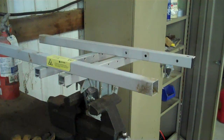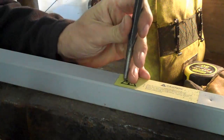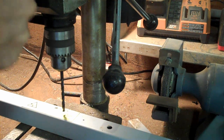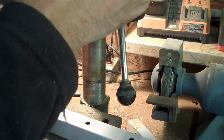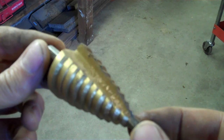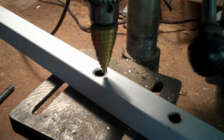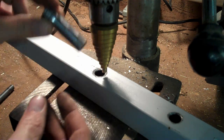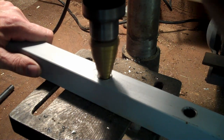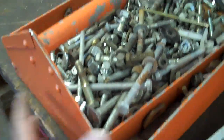I've got the square stock off of the old satellite dish, so I'm just laying this out where I'll drill these holes and bolt this together. That'll be really solid and relatively weatherproof. If you're gonna have one drill bit in your whole toolbox, it's a step drill. I've been using these cheap ones from Harbor Freight and I've been really surprised how well they've held up — they're just perfect for a job like this where you need to bore a really large hole. The bolt we're using has a 7/16 head, so the hole needs to be large enough to get the socket in to tighten down the bolt.